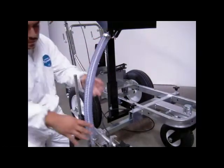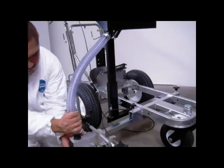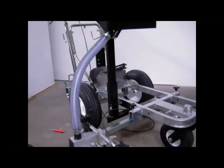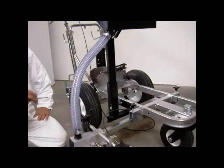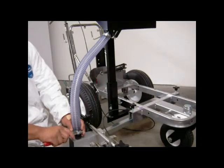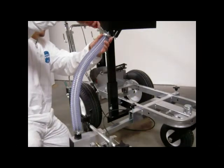Attach hoses from the bead dispenser hopper to the glass bead dispenser. The hose should be routed progressively downward so that the beads may gravity flow to the dispenser. Trim hose length if necessary. Once the bead hose has been measured and trimmed, secure the hose to the glass bead dispenser with the provided hose clamps using a flathead screwdriver.